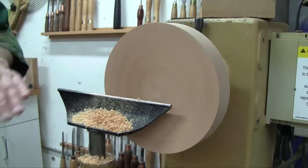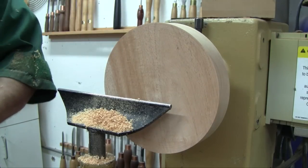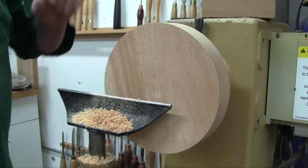That's the only thing that's a little bit more difficult when doing facework sidegrain versus spindle work — otherwise it's exactly the same cut. That's the cut I use pretty much whenever I'm cutting sidegrain in facework, and in spindle work as well. But there's more, because it turns out that sidegrain also scrapes really well, especially when you're doing facework.